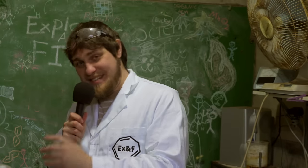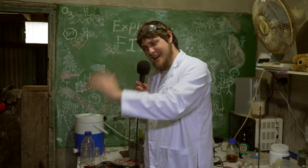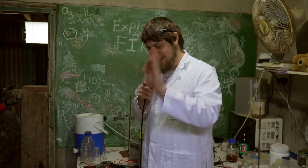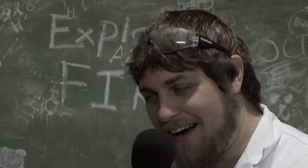No, that's genuine. People were actually very helpful, and they introduced me to an electronic component called a resistor. And we're going to be using some resistors in this episode, just so we get the correct amount of current to the LEDs. Just straight from the power supply, the 19 volt power supply, run it through some resistors and get 40 milliamps out. It wasn't that hard. I just didn't think about it properly. I'm going to make amends.